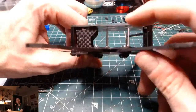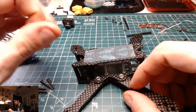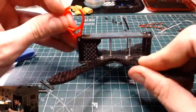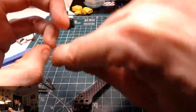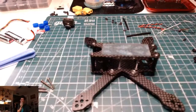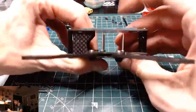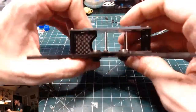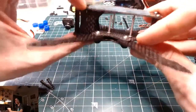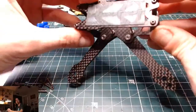The only option, you'd be able to do like a Turtle or, nope, wouldn't be able to do this either. I was about to say you could do an Insta360 Go mount, just build it with regular FPV and then hang an Insta360 Go on the front, but they use this weird M2.5, and I don't know of any mounts that have M2.5 holes in them, so I guess you could bug somebody to make you an Insta360 Go mount. I guess that's what the build is for this then. You build it with just regular FPV, flight controller, ESC, receiver, VTX, regular FPV camera up front, and then you carry an Insta360 Go or something else like that. So there you go. That's how you build this.